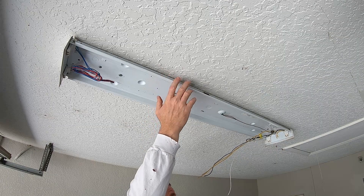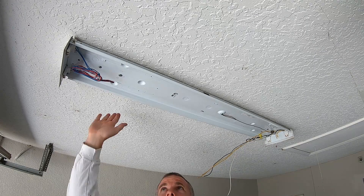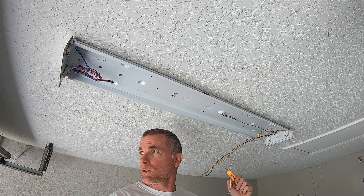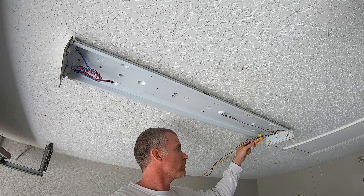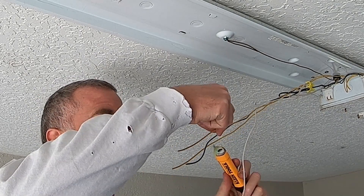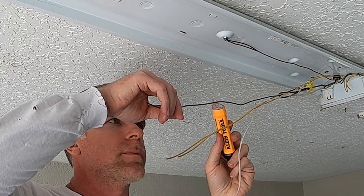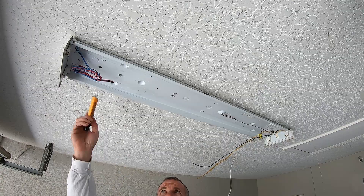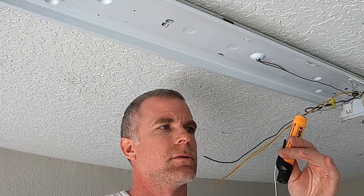Off camera I just used my Milwaukee vacuum cleaner and cleaned up some of the spiderweb and wiped everything down. If you're not sure whether you have power to a certain device — in this case our light switch — use a voltage tester. You can just come up here real quick and make sure everything is off. I did flip the power back on so right now we have power coming through here. You can see this is going to be our common, these other wires don't have power, then you get the black wire and of course there's power there. I'm going to shut the power back off. Now you can see we have no power. I'll put a link in the description for this particular voltage tester and anything else I use in this video, including the actual lights themselves.